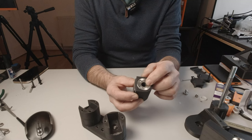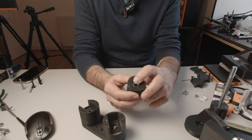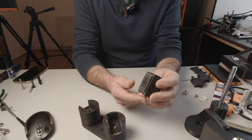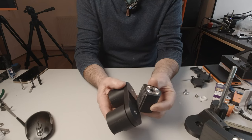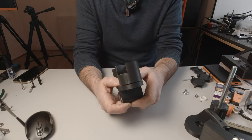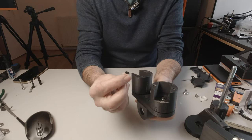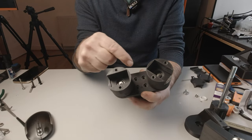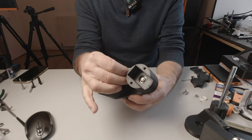Screw in a rose plate on this side of the part, and on the other side press home an M8 nut into the hole. Take this part and place it on the back, press it home, then take four 20mm long low profile bolts — there are four holes in the plate on this side — and place those through the holes to tie the two parts together.